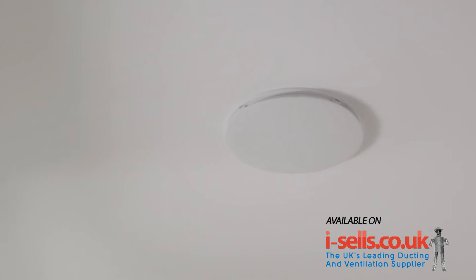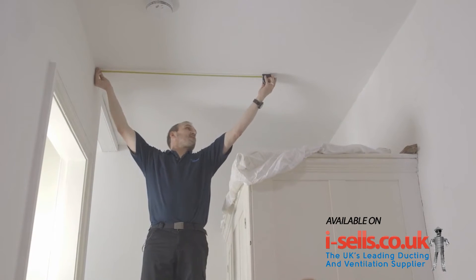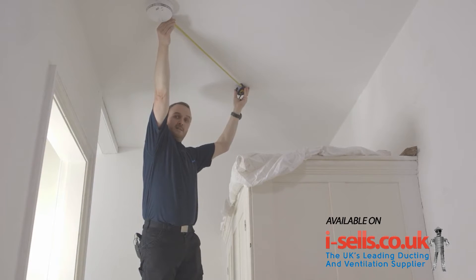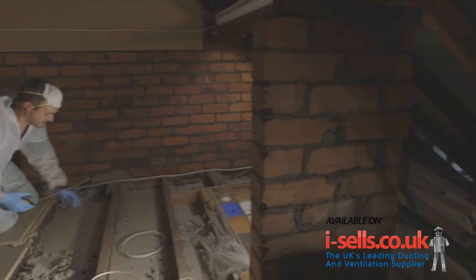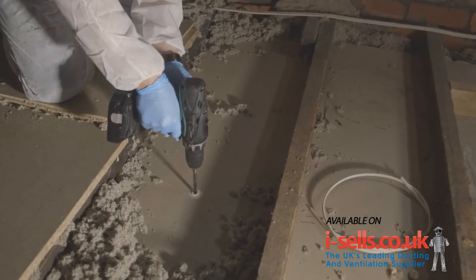The diffuser has a unique throw pattern and it is essential that it is located correctly in the central hallway. To install the diffuser, we need to cut out a section of the ceiling. Find the central location on the landing ceiling to install the diffuser. If possible, make sure that this is at least 1m away from a smoke alarm or carbon monoxide detector. Now that we have taken our measurements of the ceiling in the hall, transfer these measurements to the loft above. This should fall somewhere between 2 joists. Mark the centre point between these 2 joists — we now have the correct location to drill a hole through the ceiling to give a centre point below.